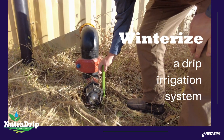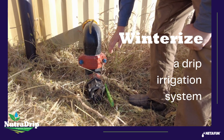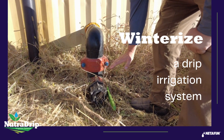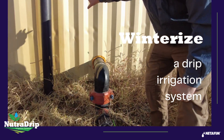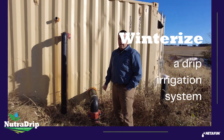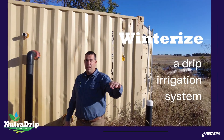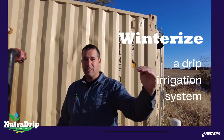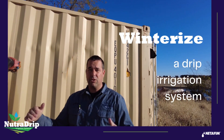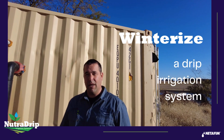I'm going to open this valve up. I had already drained this down again so no water here today, but this is ensuring that the main line is drained down to that point and the filters are dry — everything inside the container, those pipes in there do not have water in them. If you have a system where the field slopes away from the filter, then you need to go to the lowest valve in the field and remove the two-inch air vent from the main line to allow that main line to drain down to that level and not trap water inside the main line.